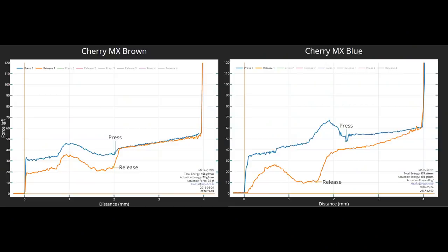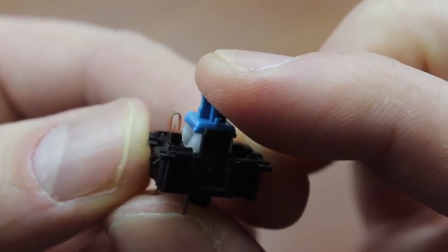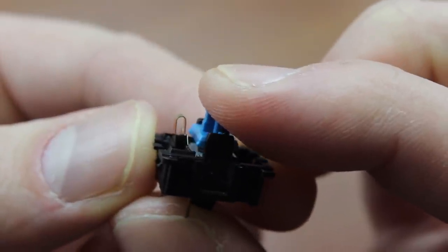It seems that originally the switches were designed for hysteresis rather than clickiness. Hysteresis essentially means that the switch doesn't make at the same point where it breaks — instead there's a gap between the two points. This is considered desirable because without it you can accidentally tease the contacts into rapid triggering. The way they implemented it is through a sliding collar, often referred to as a click jacket, though a more appropriate name might be a hysteresis collar. The slider moves more freely through the collar than the collar does across the contacts, because the contacts cause more friction.